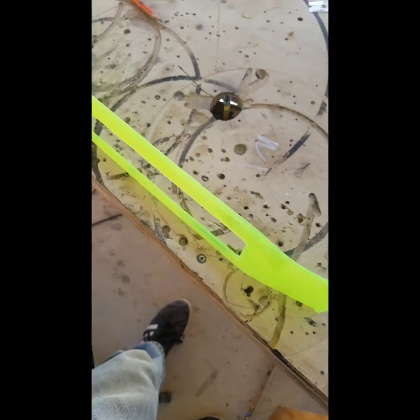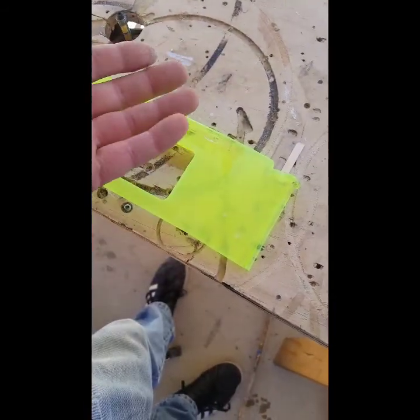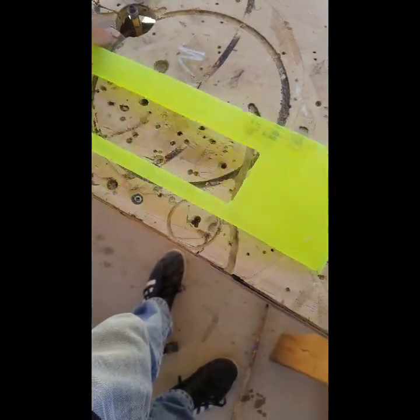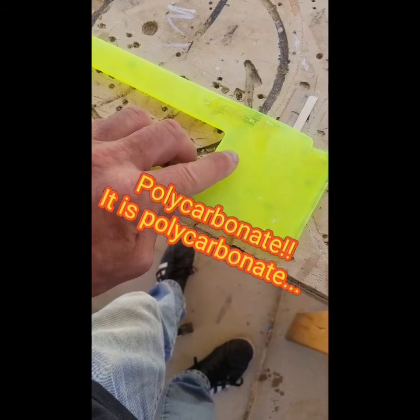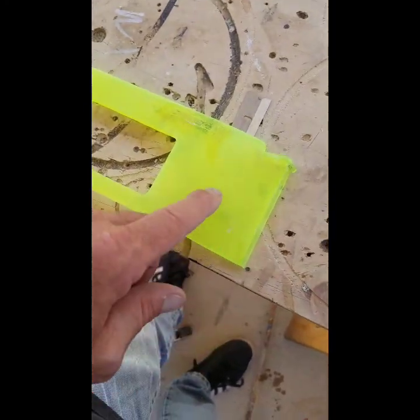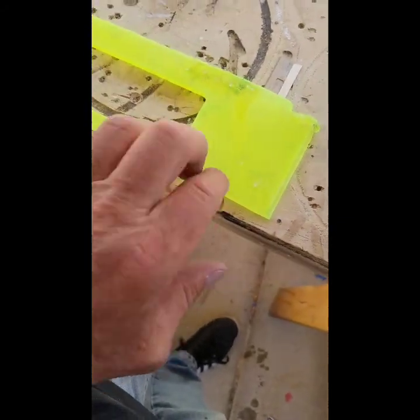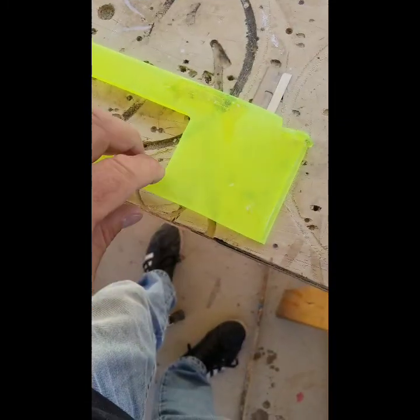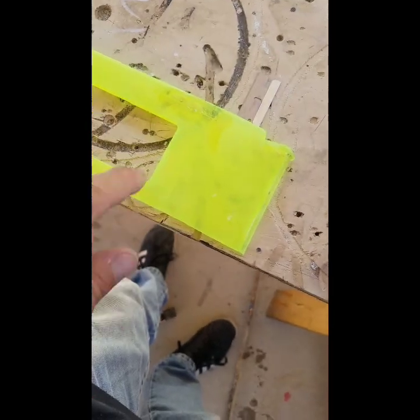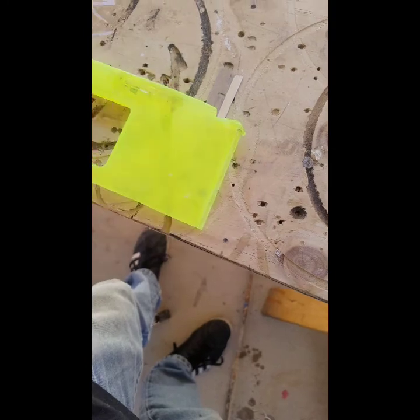I just wanted to give you this neat little tip on plexiglass work in terms of why it is such a wonderful material. There are two different types: acrylic — this is an actual acrylic — and then you have the bulletproof material which is lexan, a polycarbonate. They have two different properties: lexan is stronger, meaning it's pliable, you can bend and twist it without distorting or cracking. Plexiglass has a higher strength value so it will easily crack — push too hard and you'll snap it, like right here at these corners you could crack that right off.